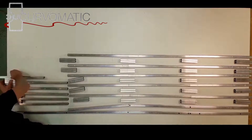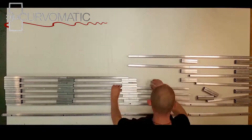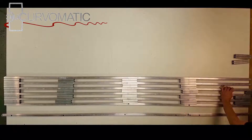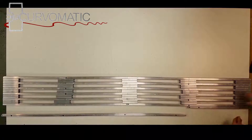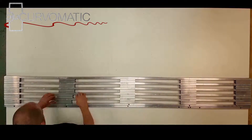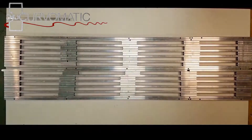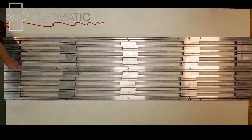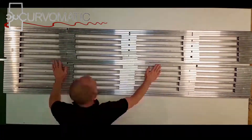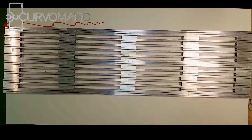To assemble your modular double hollow kit at eight feet long, lay out enough two foot and six inch lengths to make half your mold skin. Slide all the components together with the four foot drilled section from the joining kit on the outside edge, then slide the drilled six foot and two foot sections on so that the joints in the long sections overlap. Repeat this process for the other side, then join the two halves together with the remaining six foot and two foot drilled sections. Have the joint between the joining kit sections at opposite ends. The clamping skin is assembled using a similar method: use the non-drilled lengths from the joining kit and insert an extra run of two foot lengths on the outside edges to make the top skin wider than the mold skin.